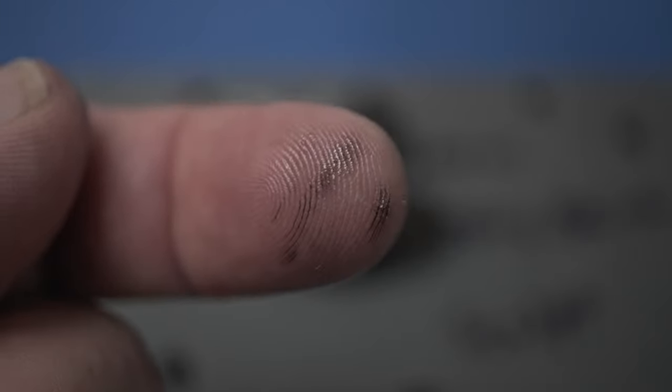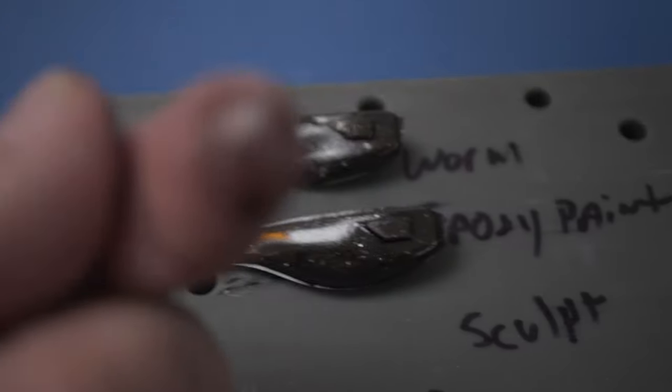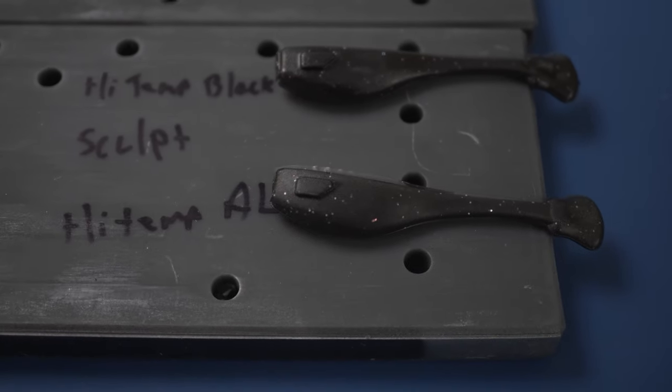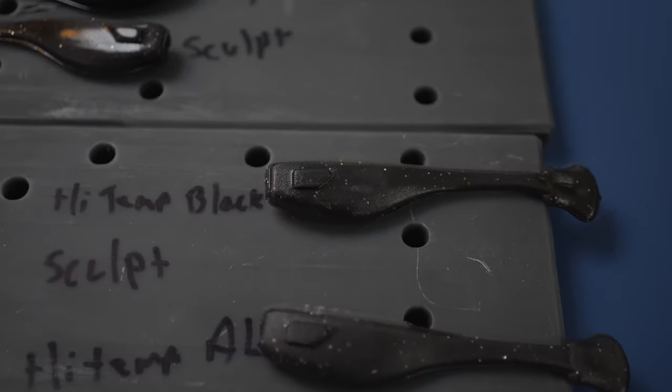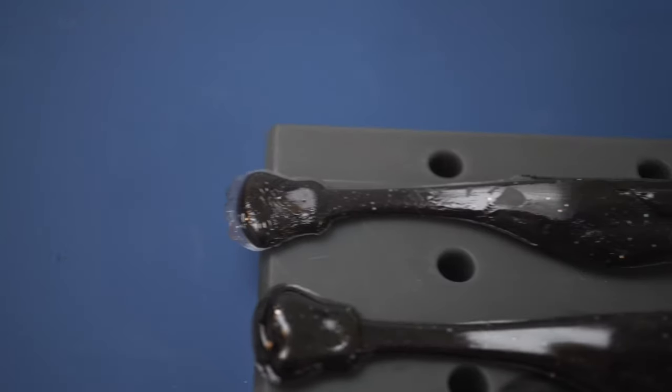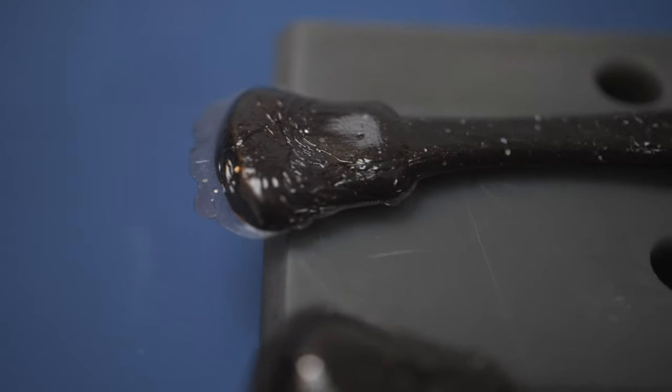When I first cracked it open, the enamel looked spectacular — but then I realized the paint had come off and was all over the lure. It couldn't handle the temps, shot at about 320°F. The aluminum high heat paint also came off on the lure, though interestingly the black didn't, but neither high heat paint was any shinier than the original resin mold. The worm oil is shiny, but it caused odd deformities — probably from too heavy a coat pooling in certain spots.